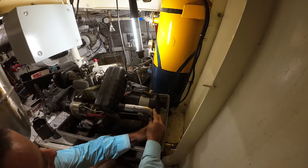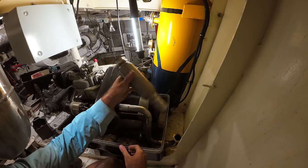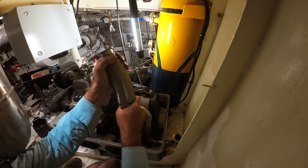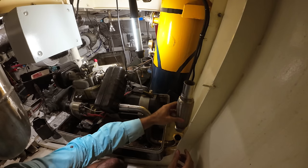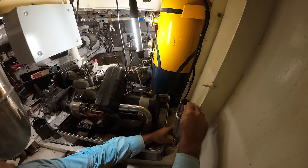So that's sitting like that. The other end of the slip joint is welded to a flexi. So exhaust flexi allows you to have quite a lot of bend going on in your exhaust pipe. So any jiggling that's over here, we can not transfer it up the pipes here. So we can basically start to eliminate that side of it.